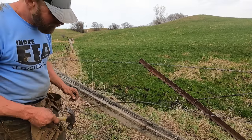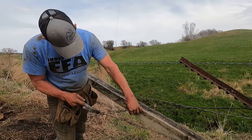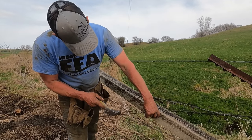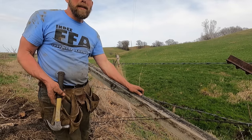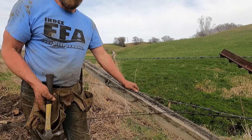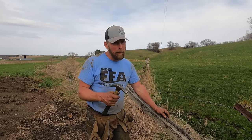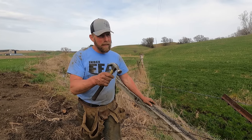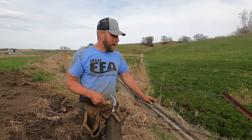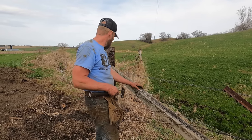There's a little notch there to hook that on, and then you put your cross wire in where we twist it super tight, and every wire that crosses or touches it is stapled to it, so this whole thing is really tied together. I'm going to put another staple because stuff like staples is so cheap. There's nothing worse than chasing cattle that get out because you're cheating on your fence. Do it right the first time — it just takes a little attention here and there. You get a tree on it, you might have to cut and re-tighten it, but that takes only minutes. You spend all day chasing cattle around, not to mention the damage they might cause.